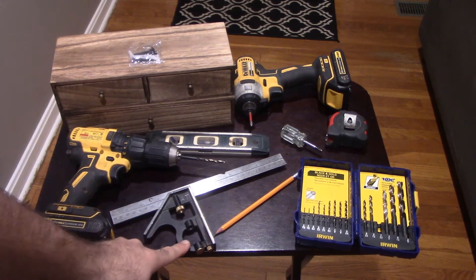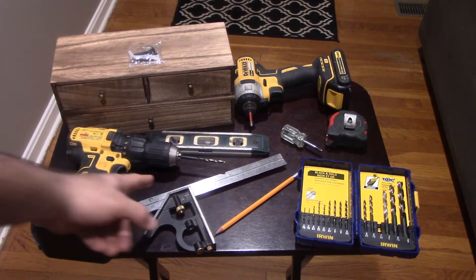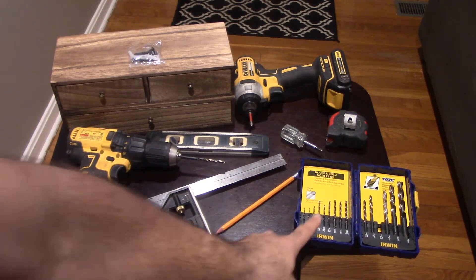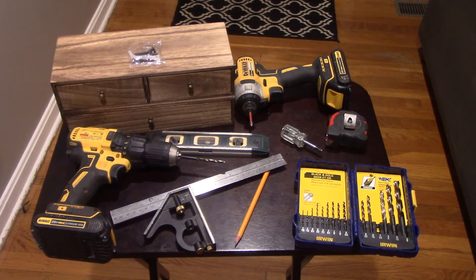Also, right here I have a combination square. You don't necessarily have to have this. The main reason I'm using it is for a straight edge because my level isn't long enough — it's only an 8-inch level and these screws are going to be 10 inches apart. So I'm using this as a straight edge and then I can put my level on top of that to make sure they're actually marked right. We have our drill bits, of course — you will definitely need those to make the holes. We're also going to need a tape measure and something to write with. I'm using a pencil because we are doing this on a wall that's going to be exposed. You're obviously going to see any marks that you make if they're outside of where your shelves are going to be, so you want to be able to erase those. Use a pencil — it's a lot harder to get a pen or marker off the wall.